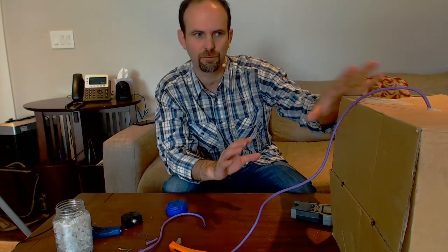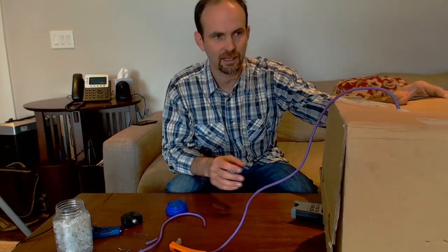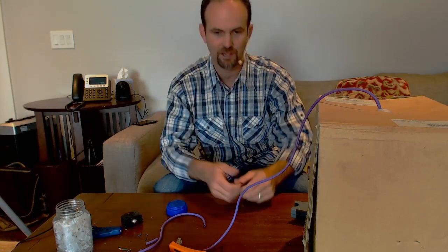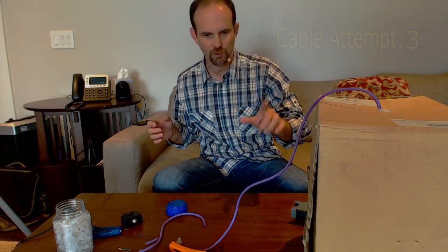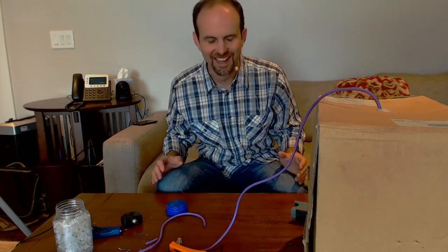So truth be told, it's a new day. I wore the same shirt so you wouldn't know that, but Ethernet cable goes 328 feet, 100 meters, before attenuation occurs. Now, it can actually go longer than that in most cases, but I guarantee you it probably is not going to go 1,000 foot, which is what's in this box, without attenuation. So my thought is, what if I just add a tip to each end and throw the whole box up there and see what happens?